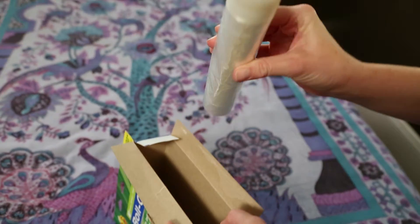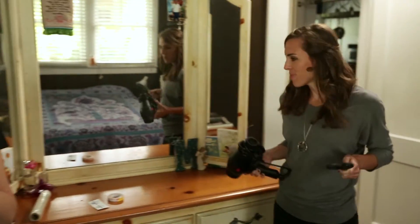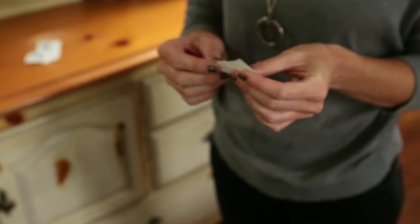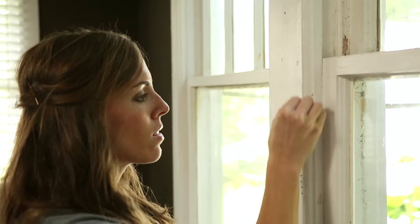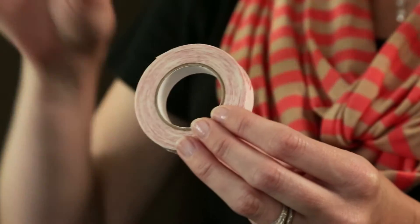This Duck Brand kit comes with a roll of plastic and double-sided tape. The first thing we need to do is prep the window frame for our adhesive, so it'll stick better. Like any project, preparation is key, and luckily there's very little prep involved with this kit. We're using alcohol prep wipes to get the window trim clean so the tape will stick better and hold the plastic film tightly in place for a long time. This is our double-sided tape that's going to go on the sides and the bottom of the window. We'll go ahead and roll it out and cut it to size and get that ready before we do the film.